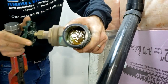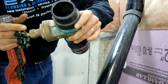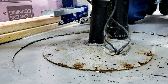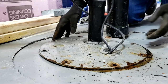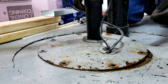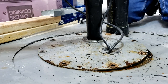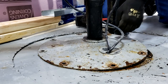As you can see, the gate valve has barely opened — so this is busted. Now that we have this separate, the plan is to dislodge the lid. Oftentimes when these lids sit here for years and years, the gasket is broken or nonexistent. If it is damaged, you'll need to apply silicone sealant to ensure sewer gases don't escape into the home. We're going to be cutting this portion so that we can take the lid right off and see what we're up against.